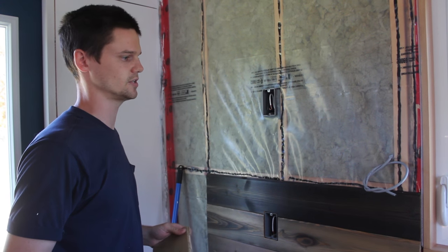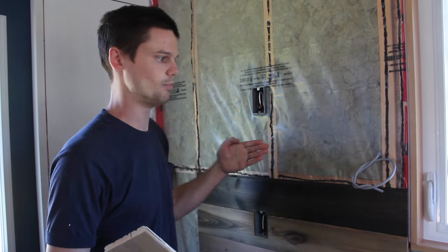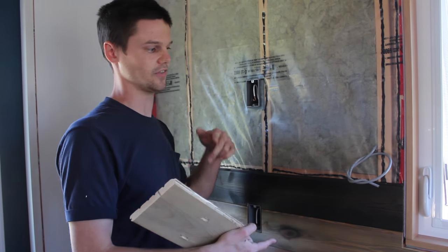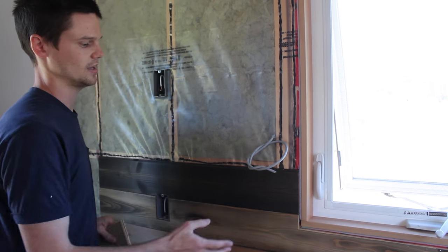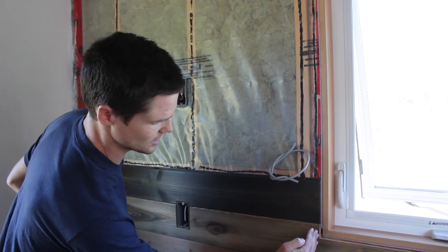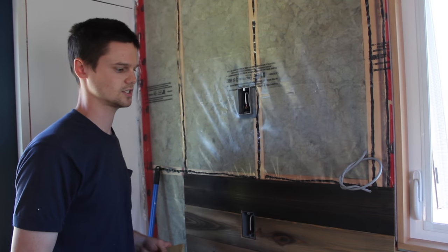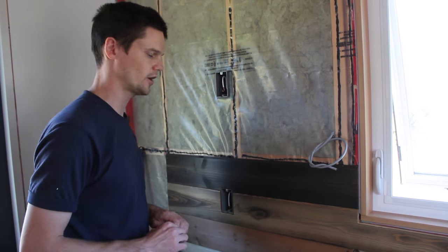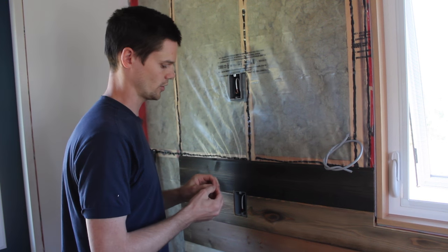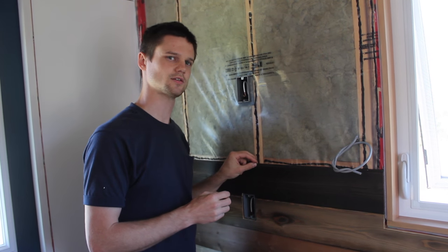This is actually easier than the exterior siding because we're not butting hard against trim that was already there — the trim's going on after. We don't have to be nearly as precise; we just need to get within about a quarter inch, and any roughness gets covered. We're also doing angled cuts wherever pieces meet, just to help the seam look nice and tight. Then we're hand-nailing small brad nails through the tongues so they're hidden when the subsequent groove goes over them. We're doing it by hand instead of a nail gun for more control and to prevent splitting, since some of the tongues aren't very thick or strong.